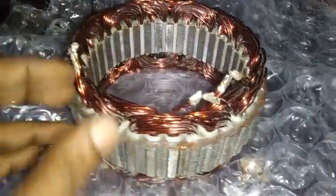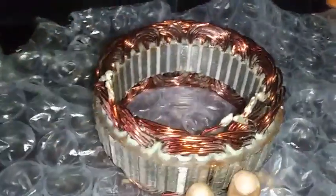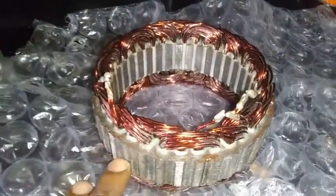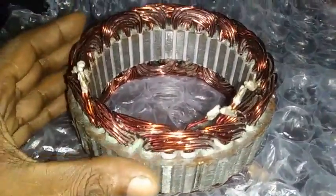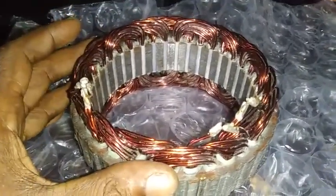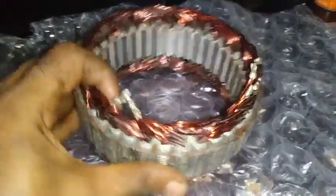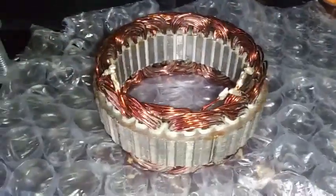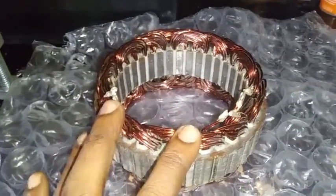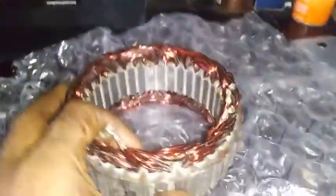Now that we've figured out this 6-wire stator field and configured it as a 3-wire stator field, it means the field will be striking the armature twice at different locations when needed, instead of striking it once with one wire. In your normal alternator, you will have three wires coming out of the stator field — these are AC wires — and these three wires connect to your brushless controller motor for triggering and energizing the field to turn the rotor.